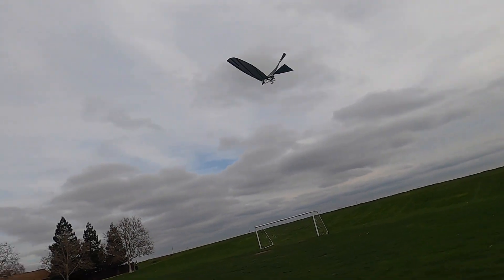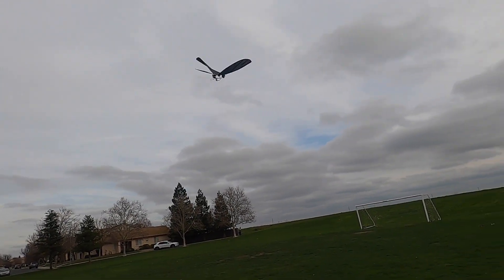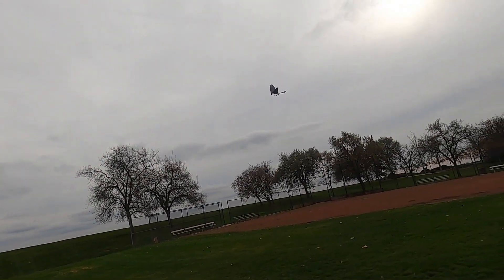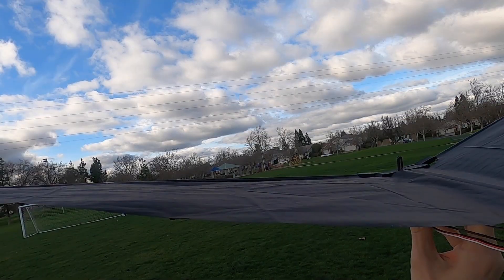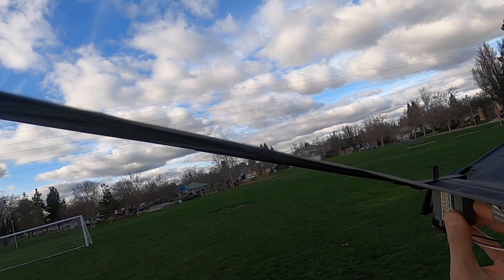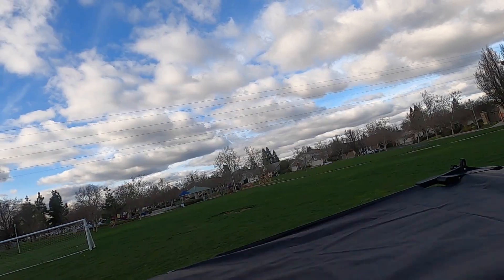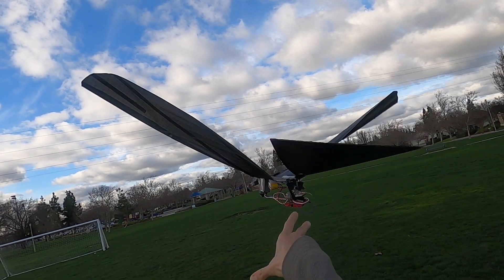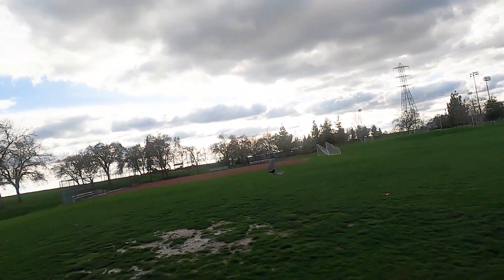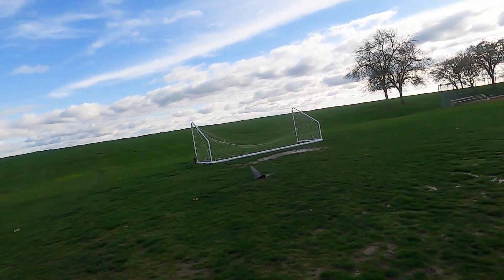With this trick and a higher voltage battery, the dual mode ornithopter was a success. In slow motion, you can see how the amplitude increases along with the throttle. With decreasing throttle, the ornithopter switches back to servo mode and lands.